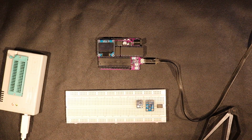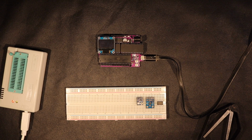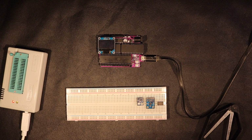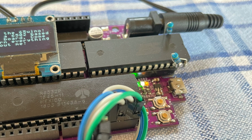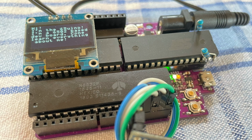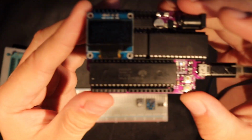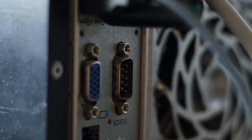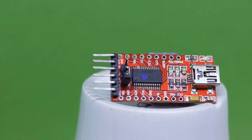So at this point, you should have a good basic understanding of how the I²C protocol works and even how to use it with a 48-year-old CPU design to display random dots. But of course, displaying random dots isn't all we're trying to accomplish here, so in the next video, we'll take a look at how to make a font so we can display some text on the display. Eventually, I also want to show how we can use a software serial protocol on the 65 Arduino to display text and load software from our computer without needing a programmer to burn the ROM every time.